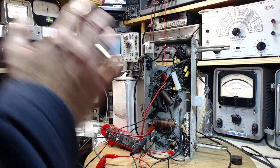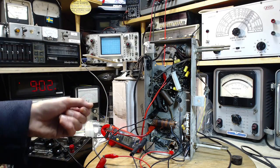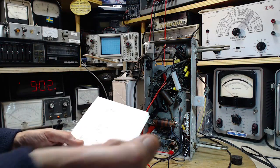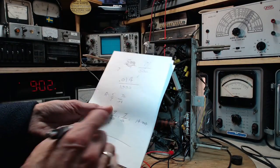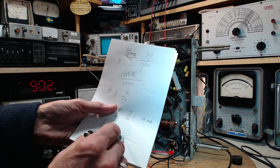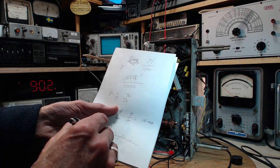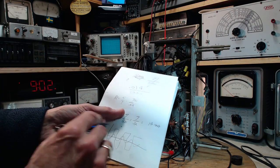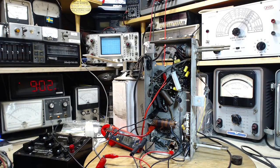So what that would sound like is at low volumes it sounds really clear, and as we turn it up, we would start to see something like this, I believe. So the low signal would look like this on the scope, look nice, and the high signal would look like this. It'd be clipped off at your top or bottom because of incorrect biasing.